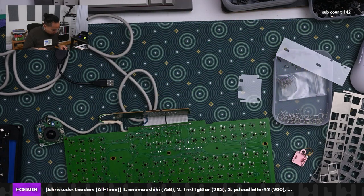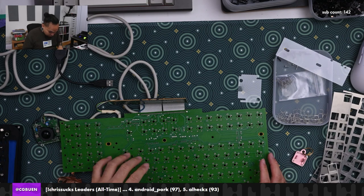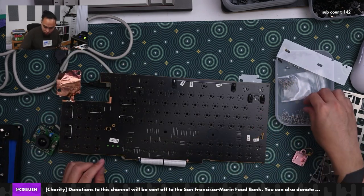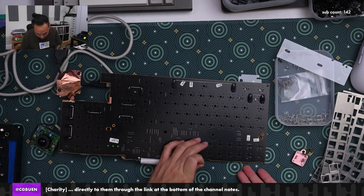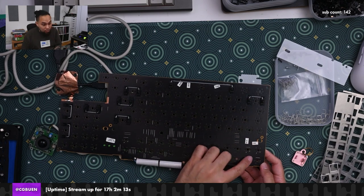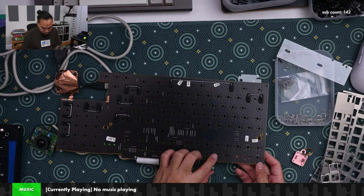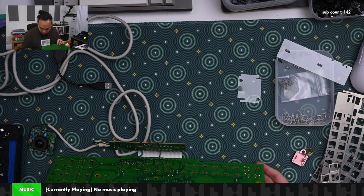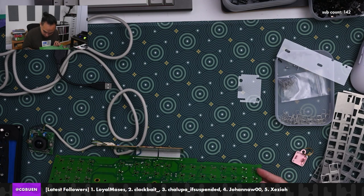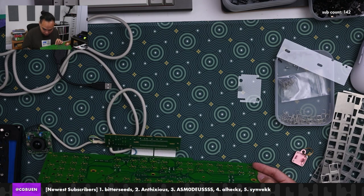And you can see from this point now, there's a lot of stuff going on here. What I think we can plainly see is where all of these jumper wires are supposed to go and how they should exist. As an example, one thing I may want to consider is throwing these jumper wires back in here so that they look a lot like the rest of what already exists there as part of the design. I would have to tape this down and then solder these in, and then when it comes out through this other side, I have a couple options here: either fold it in or cut them because they're so long, since they're supposed to sit and live within the switch, but we're not doing that anymore.